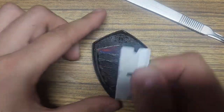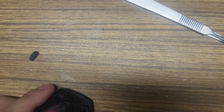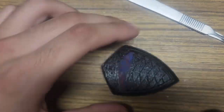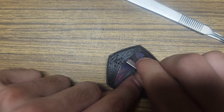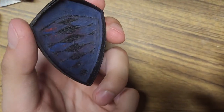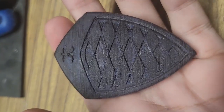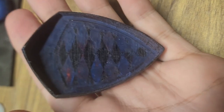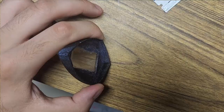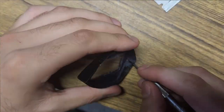For the emblem piece, I will also make the main body from three solid layers of prepreg. But due to the way that print was hollowed out in Cura, there is an inverted gap in the shape of the emblem on the underside that I need to get rid of. So I opted to fill in these valleys with some modeling clay. The uniformness would allow me to get even compression over the entire piece and prevents distortion of the carbon by not having to force it against the sharp corners. To get a good finish on the final piece, I tried to smooth out the layer lines by sanding the prints before casting them. This didn't work too well, so I opted to fill in the gaps with modeling clay. In hindsight, a better printer would have made things a lot less complicated here and later.